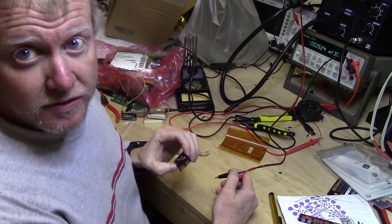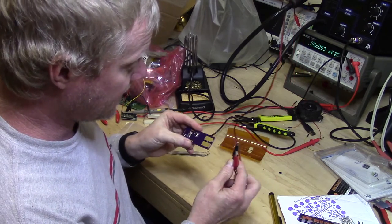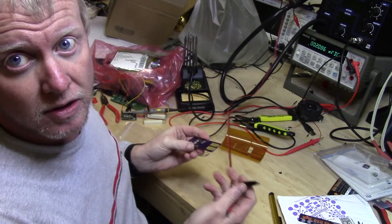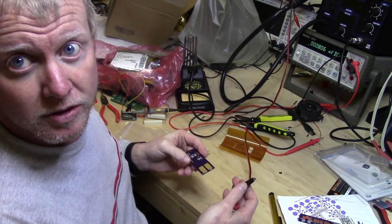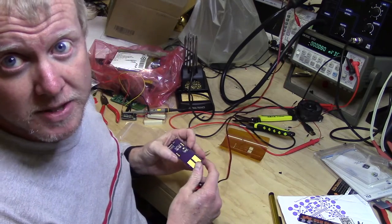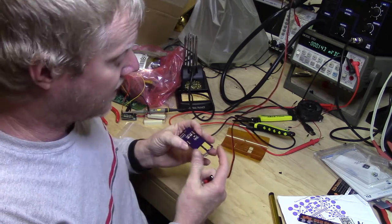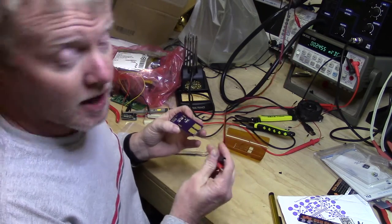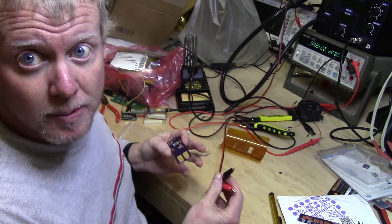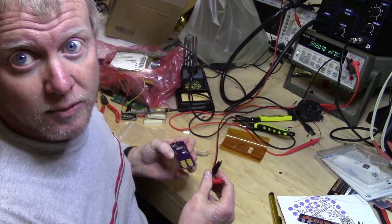Okay, a safe way of doing this testing is to use a current limiting power supply. So you want to put it on low current and kind of ramp it up to where you expect it to run. That'll prevent you from really damaging anything. Now, sometimes the quickest way to find out what's actually wrong is to obviously smoke the part. In that case, you'll want quite a bit of current to either heat up the part, or on smaller parts you need to see complete failure to find out what's wrong.